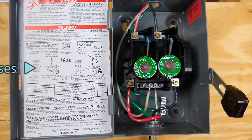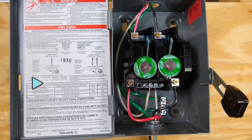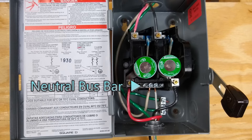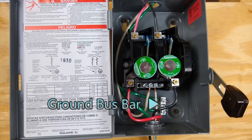Let's look at all the component pieces of the AC disconnect. We have fuses — these boxes come fused or unfused, and fuses do give you a little bit more protection in your system. Then we have the line side connection: the two hots, which would be your red and your black cable, typically in a 240 system, that connects to the electrical service panel. The load side hots carry that color coding on, coming in from the inverter — so remember, there is power on both sides. We have a neutral connection, just a simple bus bar where your neutral wires are connected together. And then we have an equipment grounding bus bar, which bonds your system together throughout.